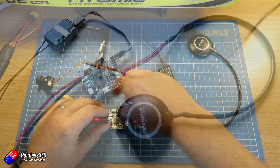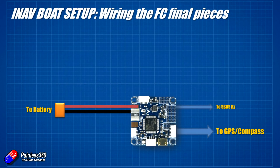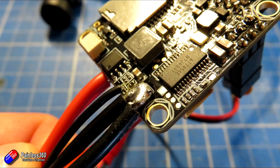Here's where we were at the end of the last video: we had a flying lead to power it to the battery, our S-bus receiver plugged in, and connections to the GPS and compass. The first thing I've done is solder on an output that's going to plug into the ESC. I'm using a plug because I'm swapping the ESC around and for commissioning there's a little trick I'll use. It also means this flight controller pod is flexible — I could move it from model to model. All the power wires are connected to the bottom pad and the output wire is connected to the ESC.